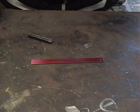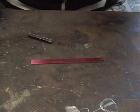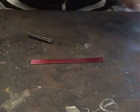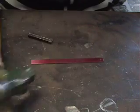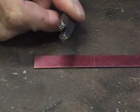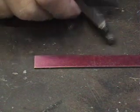The key about stamping is make sure you hit the stamp only once, because that'll prevent double impacts and additional marks on your piece of metal. I've got myself a ball-peen hammer. I have two stamps representing my initials, and I'm going to do the last one first because then I can space it from the edge.